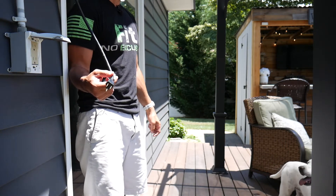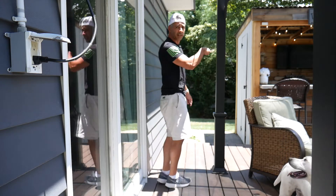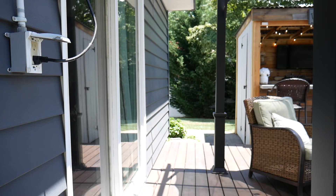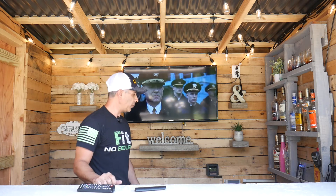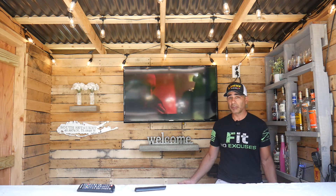The lights blinked really quickly — it went to solar. Now let's do the same thing on house power. I'm going to shut down the solar and those lights should still stay on or at least flicker a bit. Alright, here we go — solar is off. Now we're running off house power. This is just a quick test to see how fast it cuts over from solar to house power, and whether the TV drops. I'm just streaming a trailer on YouTube. So we're going to cut the power — solar is off — and it was instantaneous. Didn't drop TV. Lights didn't even flicker. And right now we're running on house power.